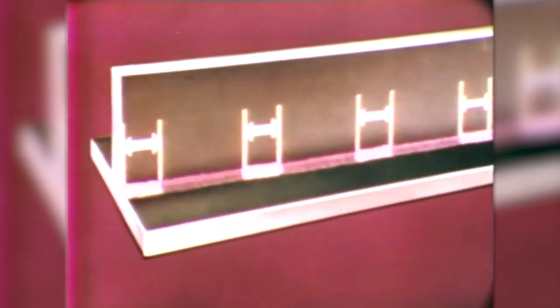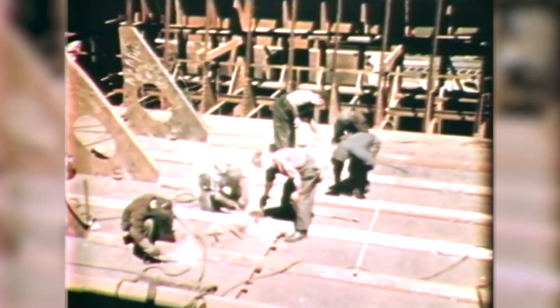In welding any structure, it is always important to consider the neutral axis. With a conventional fillet, the weld is so far off the neutral axis that Shrink has plenty of leverage to pull the plates out of alignment. But use of the fleet fillet method places the weld close to the neutral axis, greatly reducing the leverage so that Shrink cannot pull the plates out of line. Your own experience and ingenuity will uncover other methods. For example, intermittent welds frequently give all the strength required. In this way, you can use two-thirds less weld metal and reduce the effective shrinkage force by that much. On this bulkhead, good engineering design permitted the use of intermittent welds, which meet all strength requirements and at the same time minimize distortion.